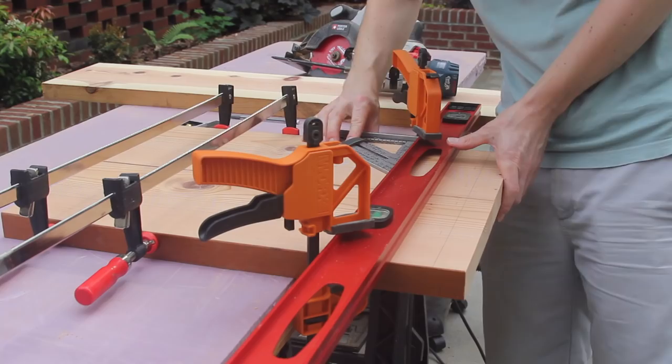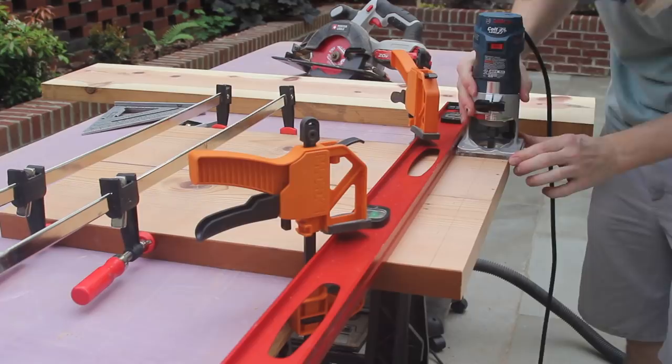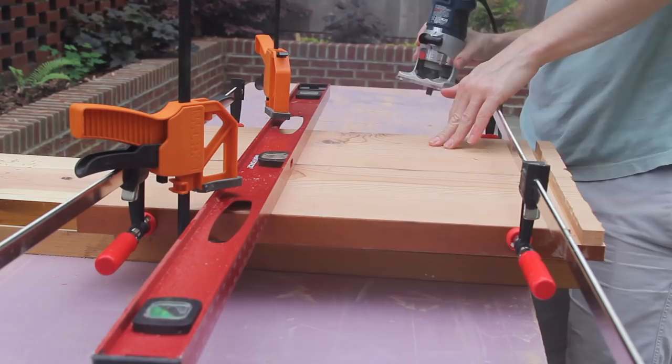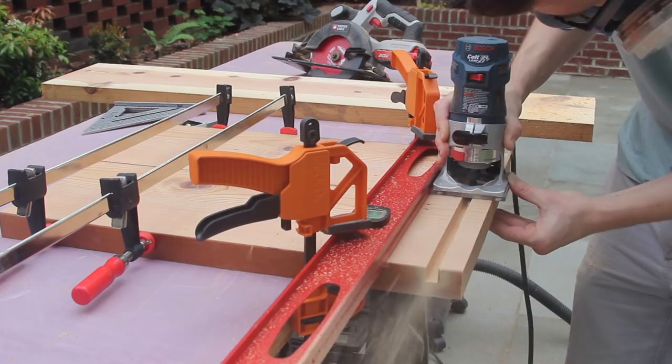There are many ways to cut these joints — I'm going to show a couple other options later, including a circular saw and using a chisel. I repeated the process by drawing and then clamping a straight edge to cut away the dado for the middle shelf.